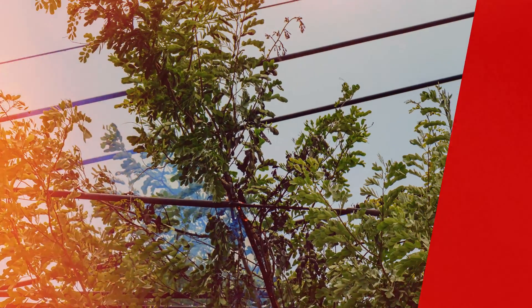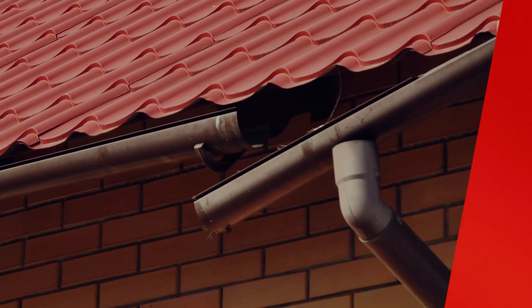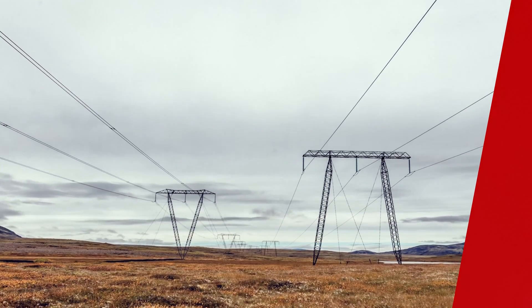What about overhead hazards? Well, overhead hazards are another obstacle that you need to be fully aware of, such as tree limbs hanging or a broken tree limb hanging on a power line. It could be a gutter hanging off of a building. You have to understand that those hazards could be down the line and could cause a hazard that could electrocute an individual if they touch a metal object that is touching the power lines.